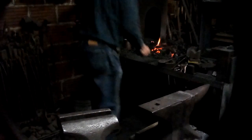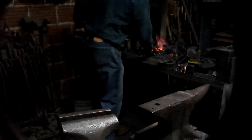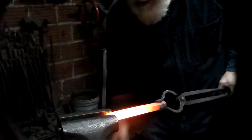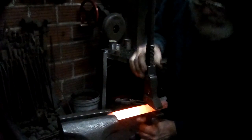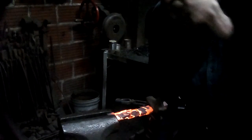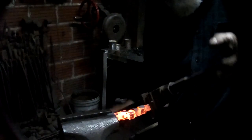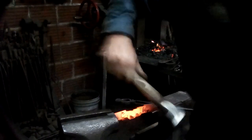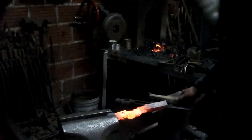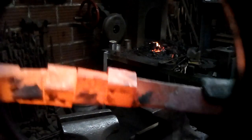Alright, so what I've got in here is a piece of 3/4 inch square that I've cut 1/4 inch deep notches on two faces, and I've soaked it so it's nice and warm. Clean off that, stick it in the vise, get my bending wrench set up and tight, and twist. Right, I got to do it like that. And what you get is the tumbling cubes, because the twists get to follow the cuts, and all of the twisting piles up where you made the stop cuts.